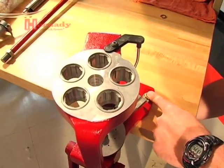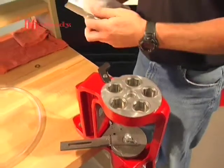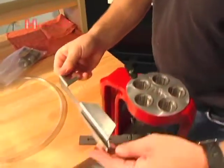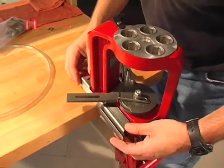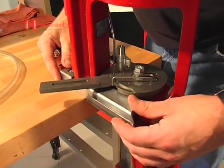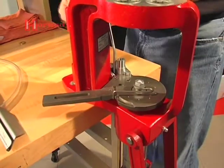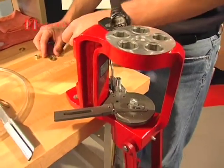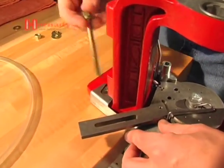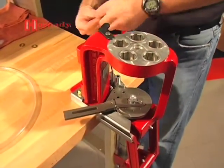One will suffice. The next thing to do is get the cartridge catch bracket and install that. You can see that it tips slightly, so we're going to use a washer underneath and a washer above. Set the washer down and bracket on. We've got a flat, a lock, and a nut for the bottom.